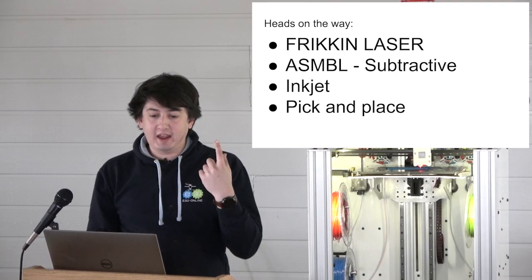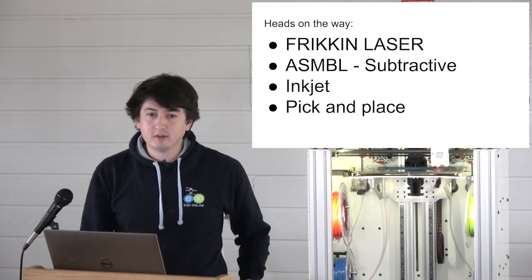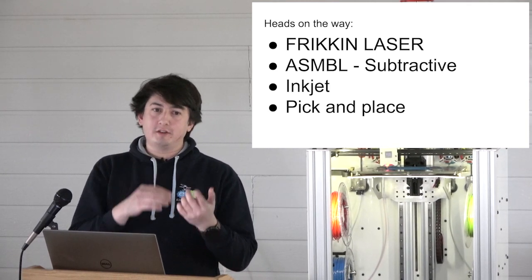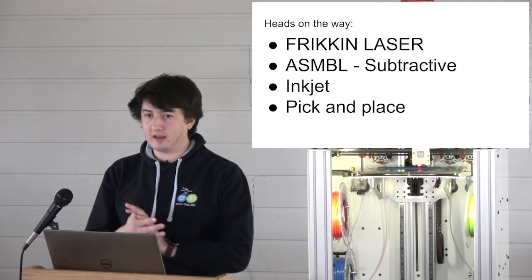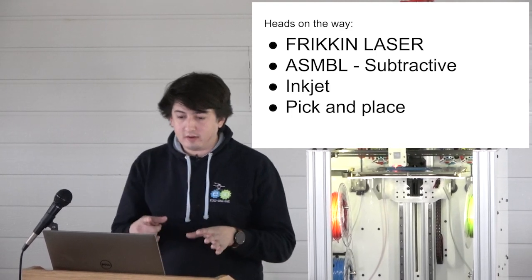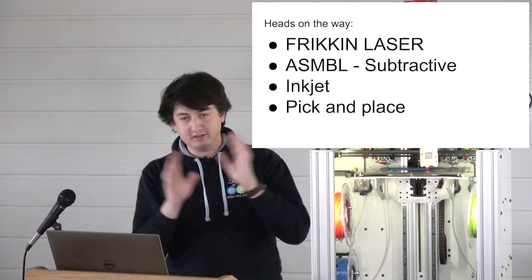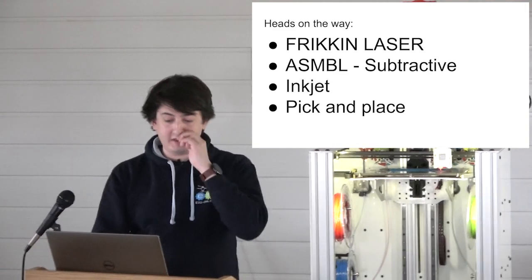So we want to put a spindle on there with a cutting bit, or you could have 3 or 4 of these tools and just one additive tool. That's a non-trivial project from the CAD CAM slicing side of things. If anyone wants to help, please give me a shout out. But I think that we can even cut undercuts, overhangs. All these things are possible with things like lollipop cutters, and it can be done. We've got a lot of machining experience. We know how to do these odd things. I think it can be done.